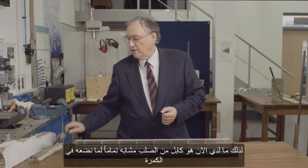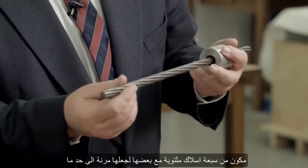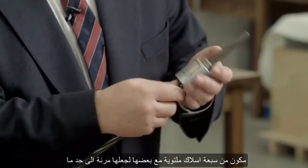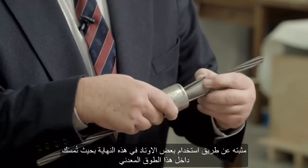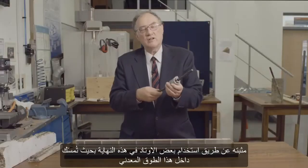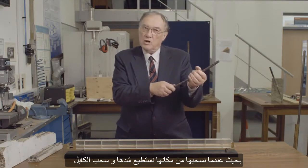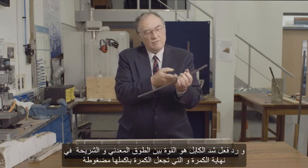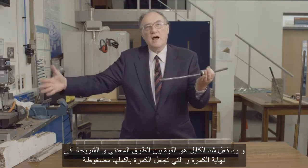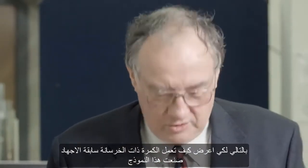What I've got here is a typical steel cable that we would put through a beam. It's got seven wires twisted together to make it slightly flexible. It's anchored by means of some wedges in the end here, which grip within this collet. When they're pulled into place we can tension them up, and the reaction to pulling on the cable is a force between the collet and the plate on the end of the beam, which puts the whole beam into compression.